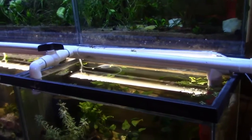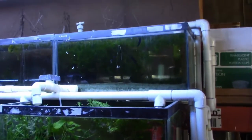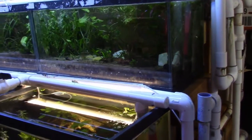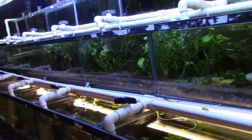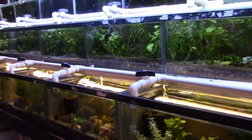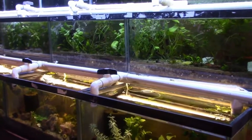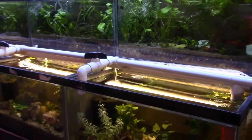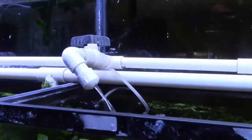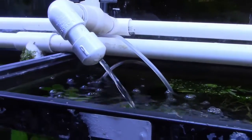Father Fish here. Been trying to decide what to do for my next video, and I've decided what I really need to do in terms of basics is show you my fish room plumbing system. Now this is a bank of 18 15-gallon tanks, and they all run on one pump. The pump is in back in a vat, and I'll show you that in a bit. But for now, the idea is we have delivery like so, flowing into every tank, and then we have overflows flowing back out down into the vat.